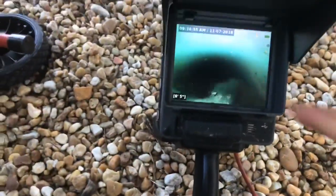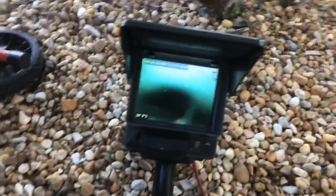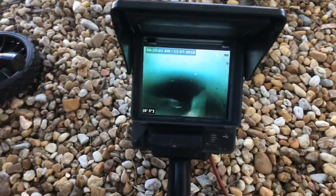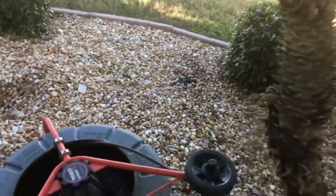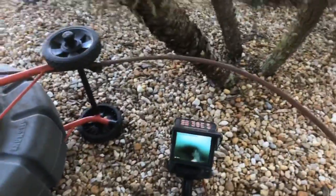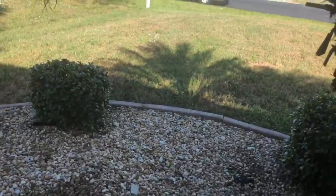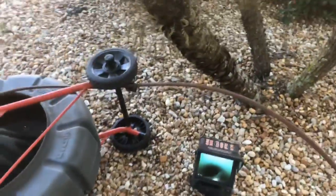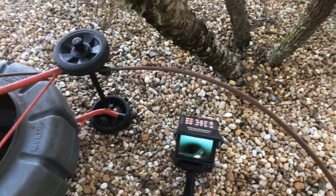You could see it going down. It's going, yeah. Okay? It's actually going to drop down. So where this point is, approximately 8 or 8.5 feet away from here, what's happening is they've taken this drain line and made it go down. Yeah. What's interesting is the blockage is right before that fitting that goes like this, right? So we know now we just got to find out what is it? What's caught? Is there something caught there?